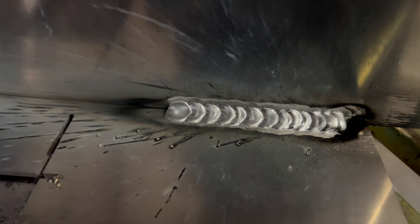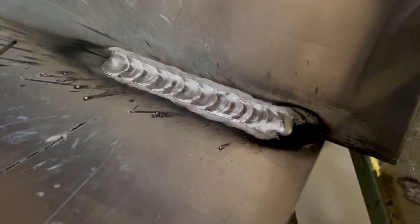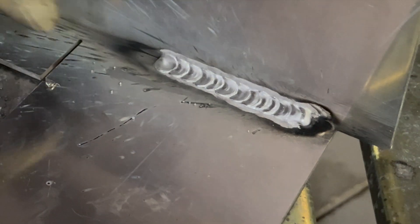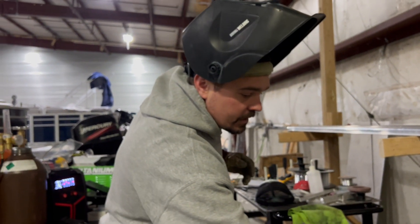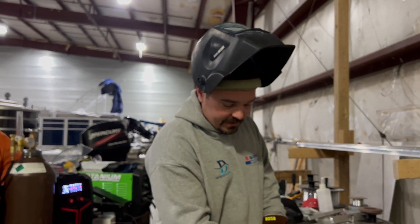So there's that fillet weld. The one thing we're going to play around with is this start — you see that big build-up? It's not super hot, that's why. In standard MIG mode I find it just gets in there quicker. But those dimes, those really nice fills — I haven't cleaned this. I'm going to grab my MAP gas torch real quick and we're just going to preheat the heck out of a spot up here and try to see how it lays in at the start.